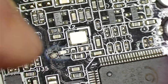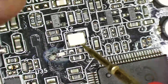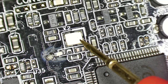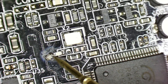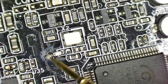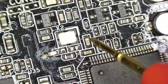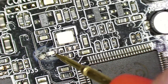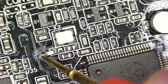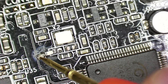If you've got electronics knowledge and want to do this correctly — and this is going to be nerdy — then we're going to figure out the capacitor values and try to find a datasheet for this IC. Typically it recommends the capacitive load for this oscillator, and then install new capacitors according to what the datasheet says. I do not have an LCR meter to measure these two, so I can't really recommend any new sizes of capacitors. But running it without capacitors might be the easiest way to get it up and running. If I get an LCR meter and figure something out, I'll mention the capacitor values in the description.